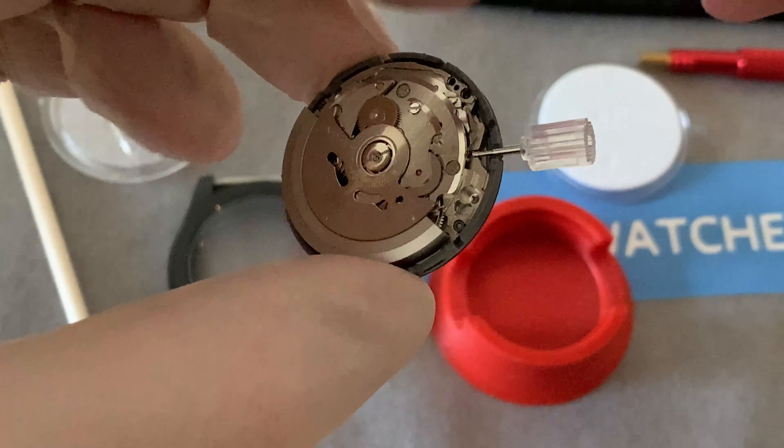I'm going to do this elsewhere because I'm worried about the dust from this metal getting onto the other parts. Basically what I'm going to do is just rub it with the file. Right, so you can see we've sanded them down - they are very smooth now. I've just been blowing it with the blower to get rid of any dust off the front of the dial as well. Usually aftermarket dials are pretty robust so you don't need to worry too much about scratching them, but best not to touch the top of the dial at all.